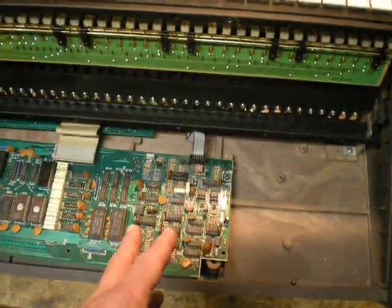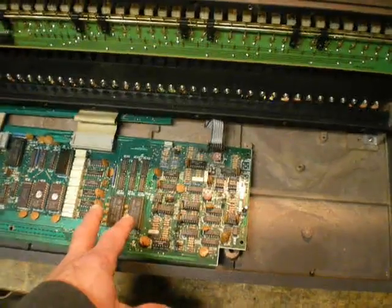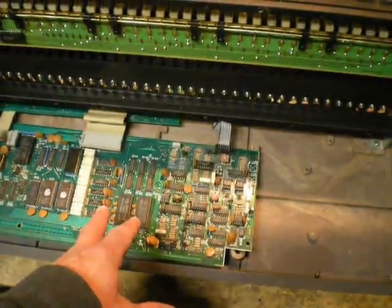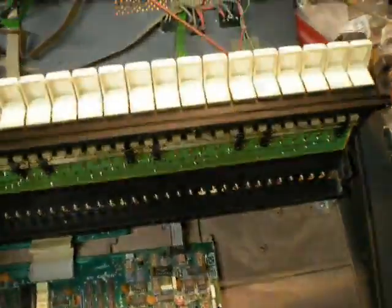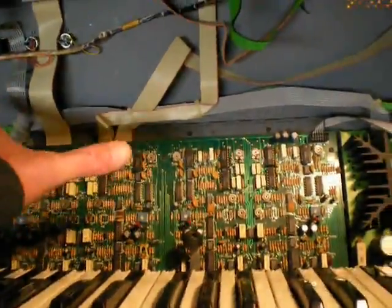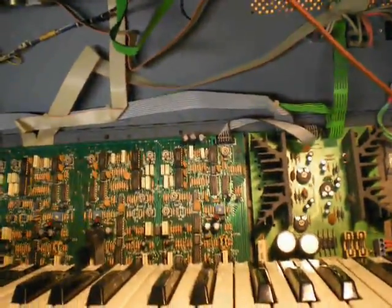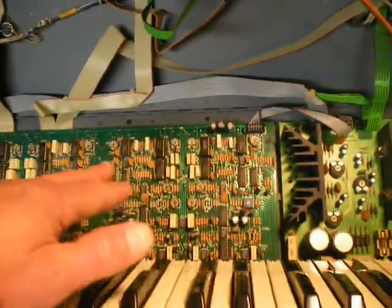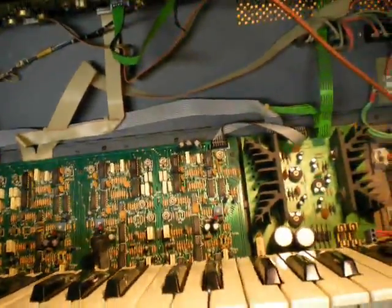Everything analog controlling those digital oscillators — essentially they're high frequency analog oscillators. They're very stable, not quite as stable as a clock, but they're very good. And these are just doing your top octave synth and divide-down function, assigning the right frequency from that network to the right synth channel. Over here you've got your six synthesizer channels — they're all mirror image layout. You've got six of those with the SSM-2024 VCA, the SSM-2044 filter, and the SSM-2056 envelope generator. So now we're going to turn it on and see what happens.